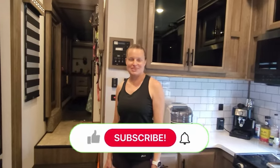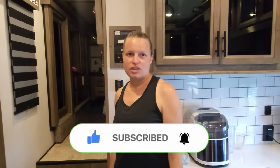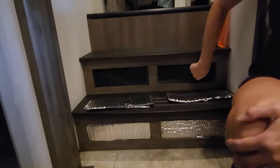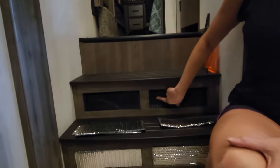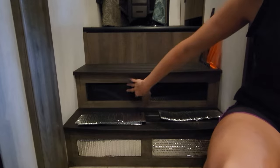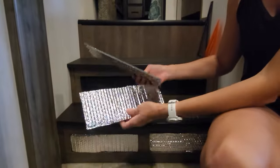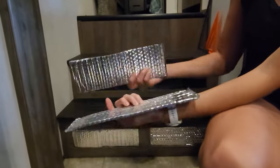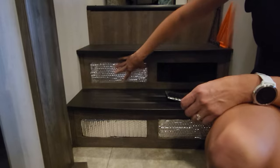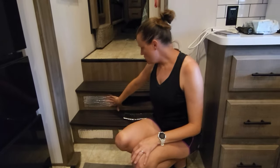All right, so we're gonna stay on topic and we're focusing on Renee now. So tell us what we got today. The problem is there's no backing behind it, so when you open up the bay outside you can see daylight, and the heat was coming in — and obviously in the winter the heat will go out. So the first thing I'm doing — I've already cut them — are those reflective panels, Reflectix, cut to size to fit in there. We've had these in the stairs already for about a month and it's made a huge difference. You used to walk up and could just feel the heat coming out.